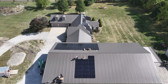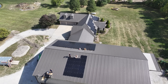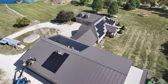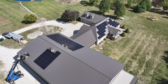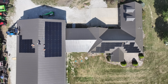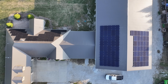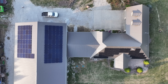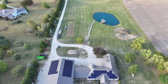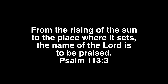It took us four days to install all 108 panels, and overall it went mostly to plan. I did not consider my stovepipe on the house, so I had to move one panel from the house to the shop — that's the reason you see the one that sticks out on the lower side of the shop. The steep roof pitch cost us a lot of time; the team did all 36 panels on the less steep 4/12 side in just the last day. We're not totally complete — we'll have to put junction boxes on two arrays, run wires for each string in metal conduit to the inverters, and figure out how the rapid shutdown devices work. What questions do you have? Let us know in the comments below.